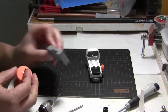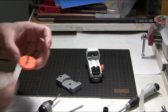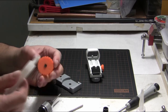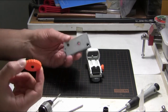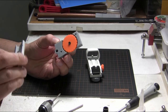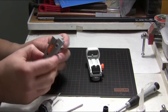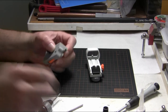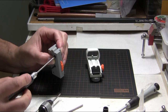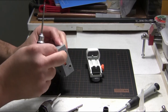For the mounting of the sight, I'll get the Z-adjust wheel. I'm going to put a little bit of grease on the top of the nut, the side of the nut, and on the bottom of the bolt because it actually pivots on these. Put that through the central hole, then get the lower part of the mount — that hole goes over the head of the bolt. This is secured by two M3x10 bolts.